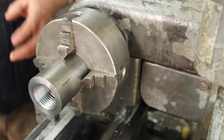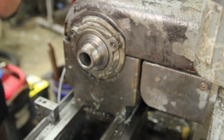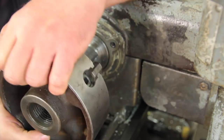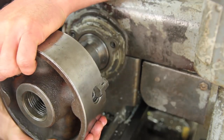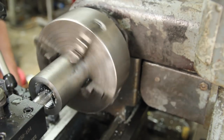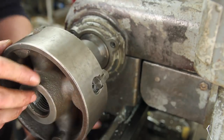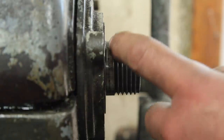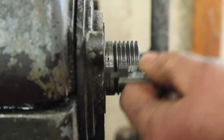If I take this out of the chuck to check the fit, I'll lose the position for the thread. So instead I'll just take the whole chuck off. It's a little tight. Fifth time's the charm. And the next thing to do is to cut this register in here — this is an inch and a half by not very much, about a quarter inch deep, maybe go a little deeper than that.